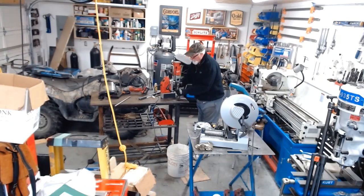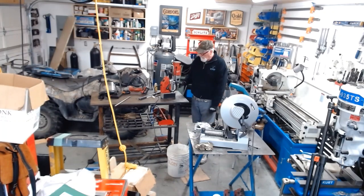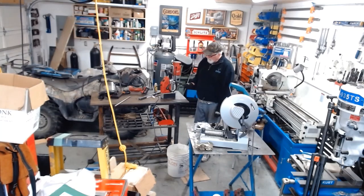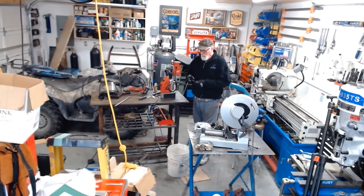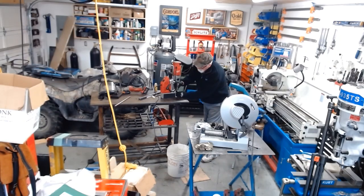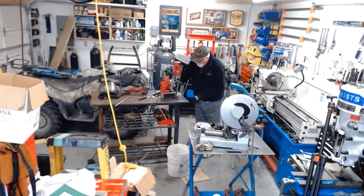There's the pilot hole drilled. The drill size I need is 27/64. I had one in my collection, but this mag drill is mainly set up for using an annular cutter. It does have a little chuck that slips in, but you lose a bunch of travel in the process. I cut down a bit but it wasn't working great, so I got hold of our jobber on Wednesday and he came up with some stubby 27/64s for me. These definitely make life easier.